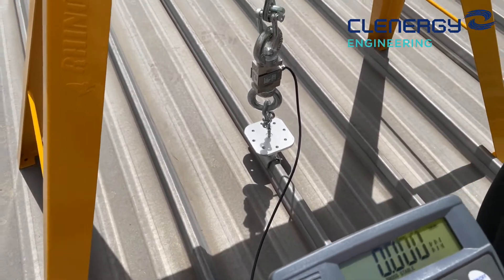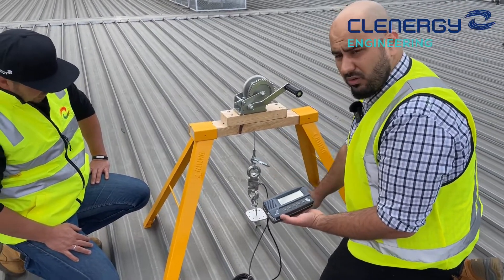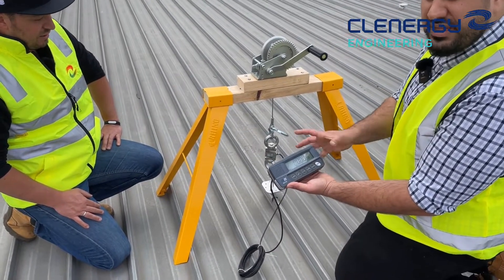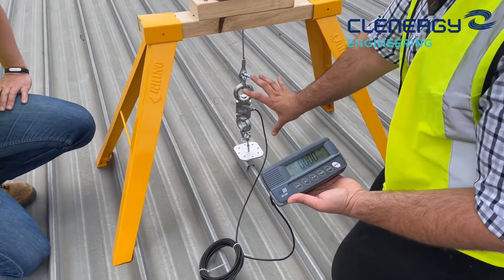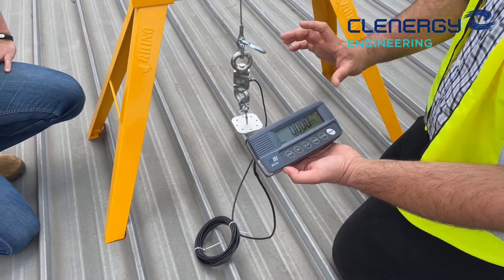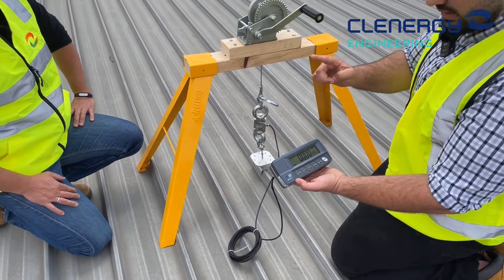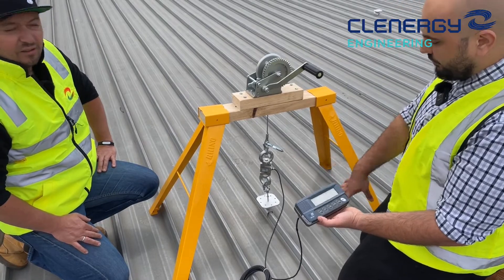A really important step is to make sure that when you start there's no tension in the system at all, and that you've zeroed out the reader by clicking the zero button. You can find a zero button on any of these devices, which sets it so there's no pressure being read on the system. As soon as you add any level of pressure you'll see this number slowly rise, and it's very important to keep an eye on this number to make sure you're not over-exerting what's happening on the roof sheet.